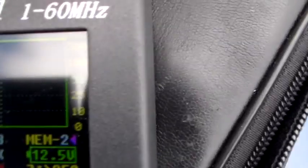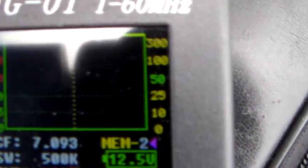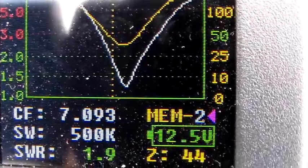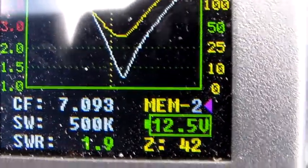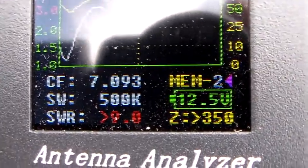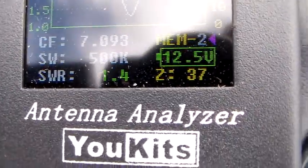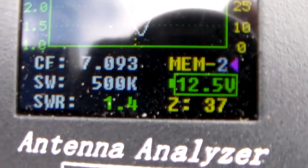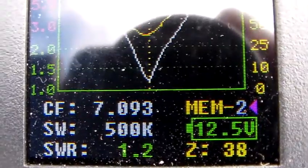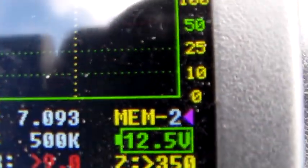Let's see if we can get that. The trouble is it's daylight so I'm not sure you can actually see that screen in this light. That's 1.8 at 53 ohms. That is 1.9 at 44 ohms. Have I had a sweet spot here? I think with these solid state radios, it's probably better if you get it closer to 50 ohms regardless of what the SWR is. That's 1.4 at 36 ohms. They do say when you're tweaking these, only move them a few millimetres at a time.